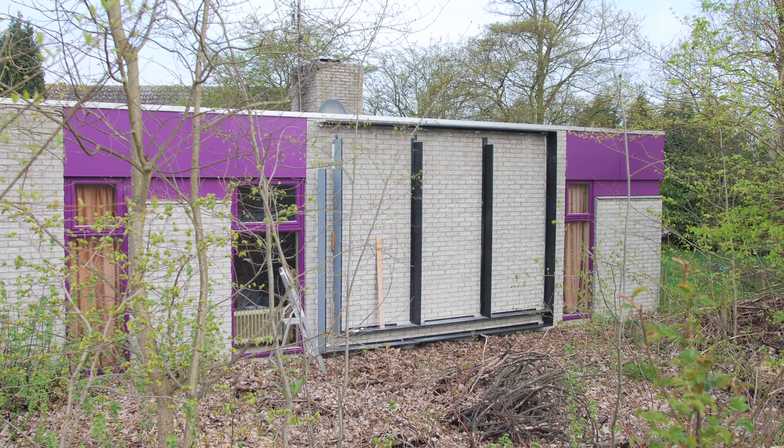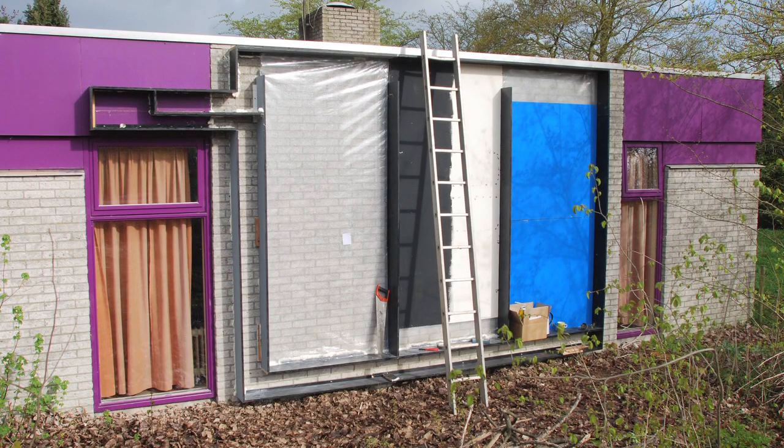With some duct vents blown back into the house. I built the collector on the wall. You can build a closed collector first and attach it to a wall, but collectors this size become very heavy. Between the wall and casing I used bubble wrap for isolation. On top of that I placed some used hardboard sheets. When it was done I painted the whole casing black.